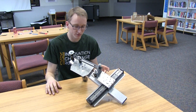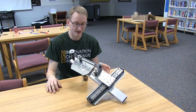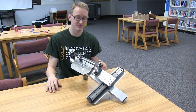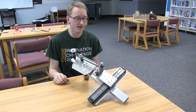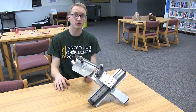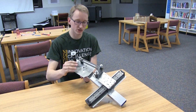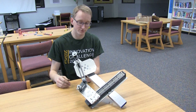The reason we ended up not going with this is because it's pretty high maintenance, it tends to break down a lot, and we don't really have time in three days to make this the way we should. If you were going to go with this for your robot, the best thing I could suggest is that you need a pretty high torque motor, because when it gets to the quick-return point where you're actually hitting the ball, it takes quite a bit of torque.